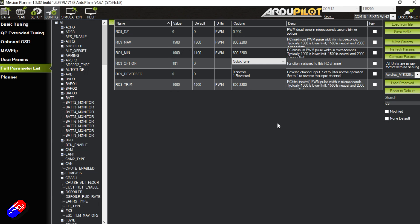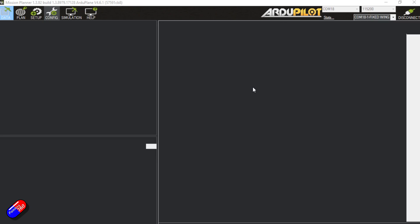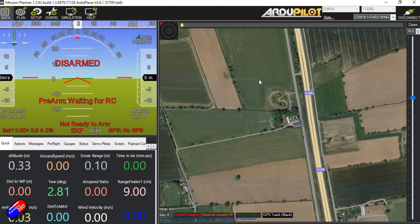So from a fresh install of ArduPilot 4.6 and above: enable QuickTune, then assign a switch to trigger it. As you'll see in the in-flight video, you take off — it should be safe to fly and free from huge oscillations — and ideally you would perform some notch tuning first if possible. From a loiter, initiate QuickTune. With a three-position switch, put it to the third position to save. With a two-position switch, set an autosave delay of five or ten seconds and it'll save once tuning is complete. Super simple from 4.6 and above.